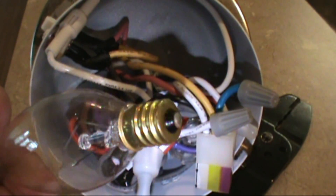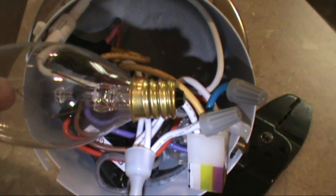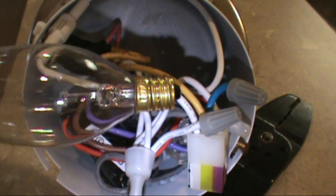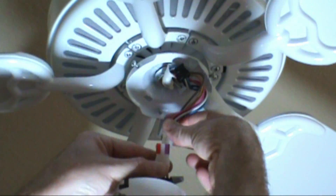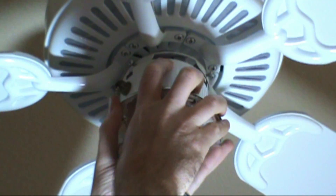I like to throw some new light bulbs in for them. These are the small base bulbs. They put a limiter on a ceiling fan that takes 40-watt small-base bulbs — I mean, to get a resident to change their own light bulb is impossible. So to think they're going to put some crazy wattage bulb in there to cause damage is not likely going to happen. Black to blue, black to blue, cap off the white. Let's plug it back in — there's only one way to do it. If there's any resistance you're doing it the wrong way; it should just slide right in.